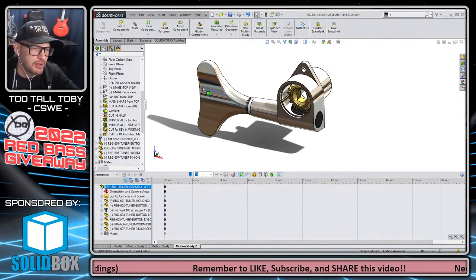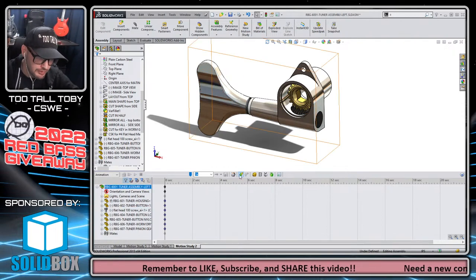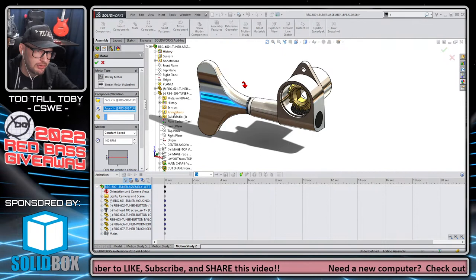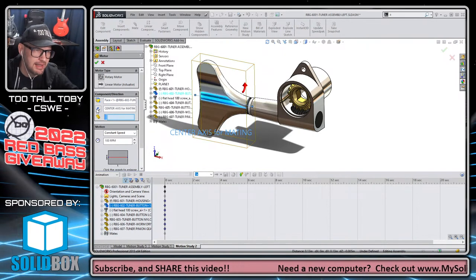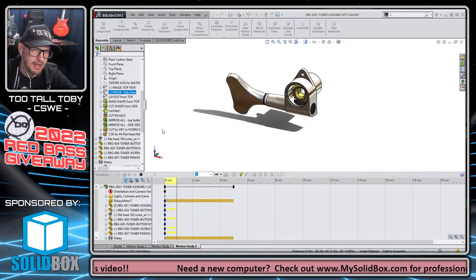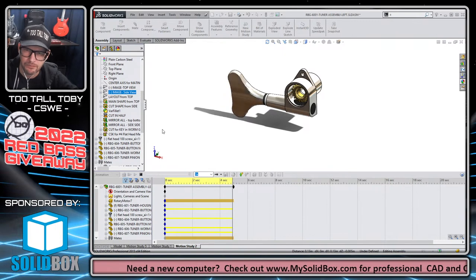Now that we've started a new motion study, let's go to our rotary motor. So motor, rotary motor on this component, rotating about this axis, the axis that I created for mating, rotating in the opposite direction and at an RPM of 30 RPM. Let's hit the green check mark for that motor. Let's do a calculate study, calculate animation. Kind of get this thing started.